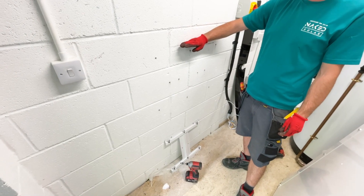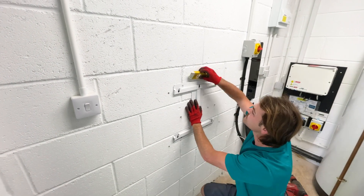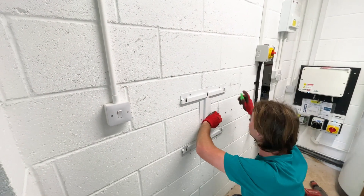Your system must be 1,150mm from the floor to the top of our bracket for floor mounting. If removing the sleeve, it must be a minimum of 1,200mm from the floor to the top of the bracket.